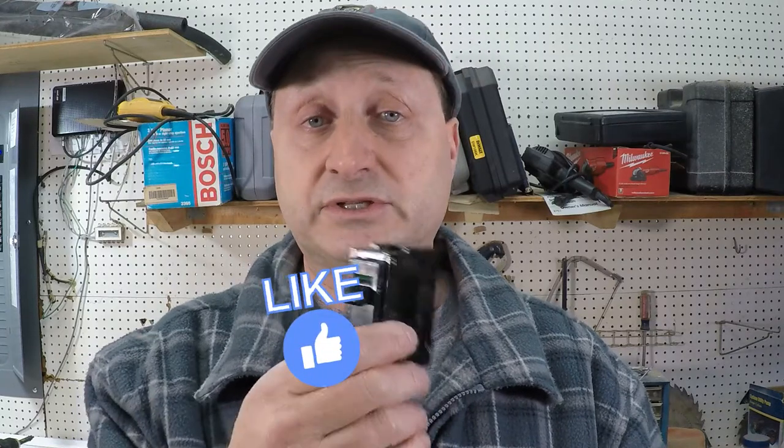The good news is we have LED bulbs today. When you had a 60-watt incandescent bulb drawing 60 of the 1,800 watts on a 15-amp breaker, now you get the same number of lumens from only an 8.5-watt LED bulb. Converting to LED lights will help limit the amount of power that goes through your breaker and electrical lines downstream, helping to prevent a potential trip down the road.